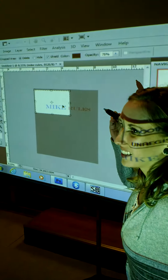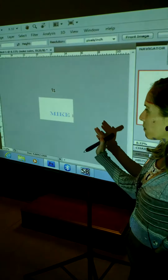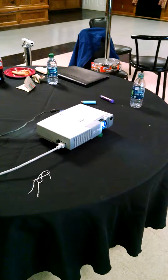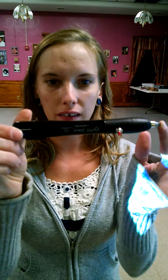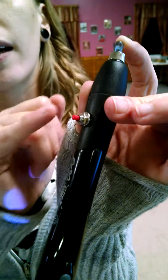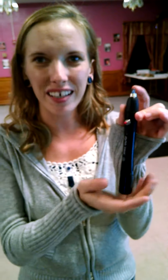I need you to hit enter. This is the problem — there are some limitations. You cannot click enter from here, and you cannot type. But as long as you have an assistant working with you — wonderful Mike, he is my Vanna today. It is actually a hack that was done by a CMU student. This pen is quite simply an Expo clickable marker, low-odor dry erase. The back pops off, you pull the ink out, and inside the marker you place an infrared LED light. You solder that directly to your switch, and solder that switch into a battery, which is contained inside. The original pen had a separate battery, but we put it inside and made it all in one.